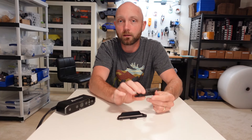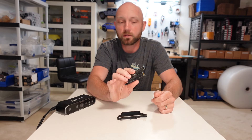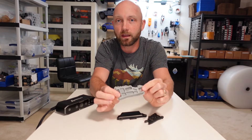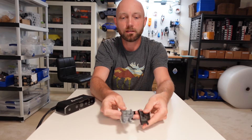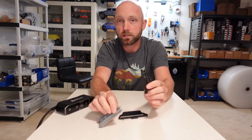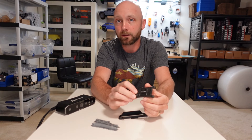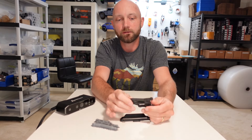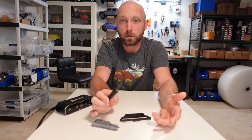I've been playing around with the CR Scan Otter for the past couple of days, trying to figure out a good way of getting 3D scans of these RC car parts. Initially I was having a lot of trouble with these little parts, but I've come up with a good repeatable process. Here's an example — this is a 3D printed copy of a scan of this A-arm. It printed out quite well, and scale-wise it looks to be exactly the same, which is pretty cool. The biggest issues with scanning these RC car parts are that they're black — black absorbs light, making it really hard for a scanner to pick up — and they're kind of flat with two sides, so when you flip it over, it has a hard time tracking and merging the mapping from one side to the other.